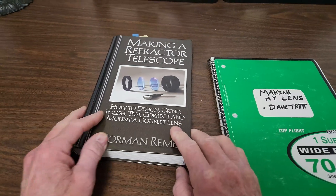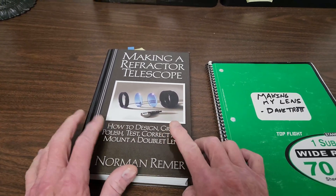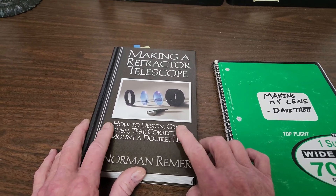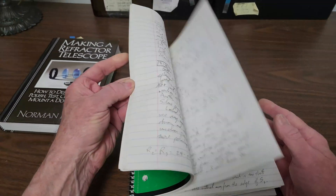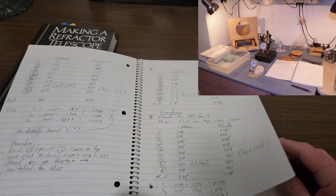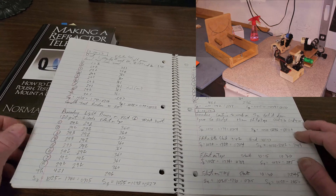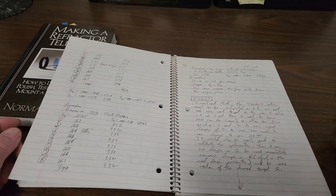This is the book I used when making the telescope. This is the first and only refractor I've ever made from scratch. I started with a kit from Newport Glassworks — it's a four-inch kit meant for an oil-spaced objective. I used the design as they specified. However, I had to modify it because what happened is detailed in this notebook. This is many, many months of work. I got carried away with one of the grits and went too far, so I had to change it from a four-inch F-15. It ended up that I had a turned edge anyway.